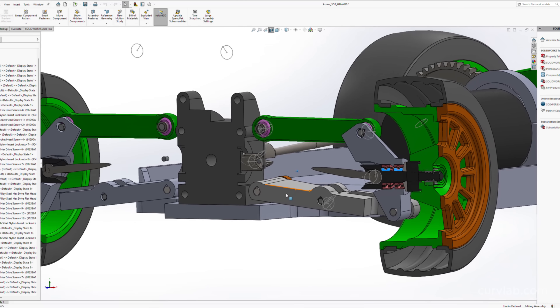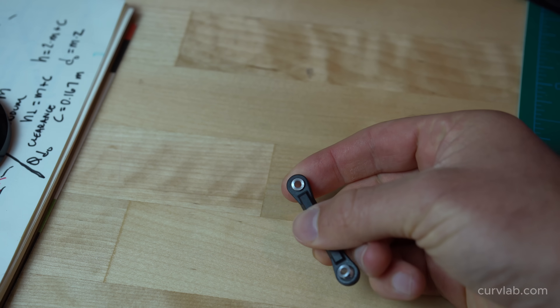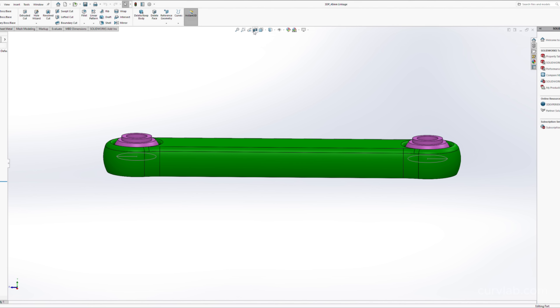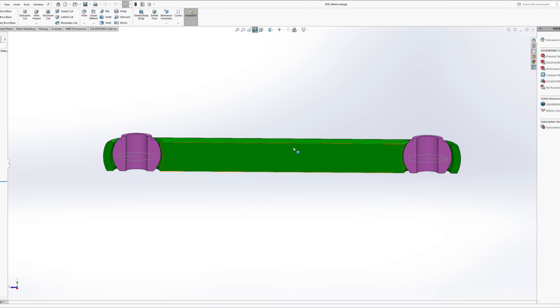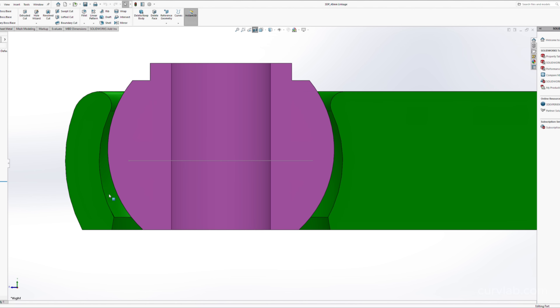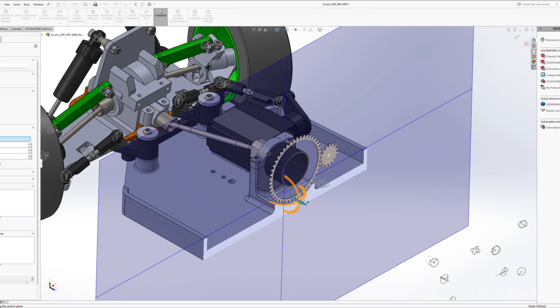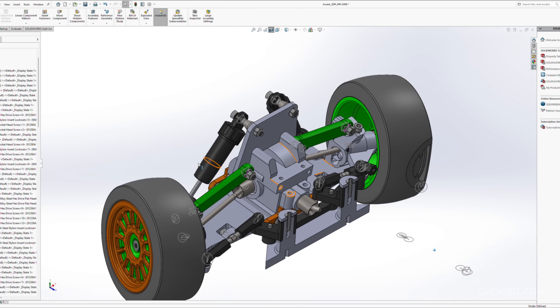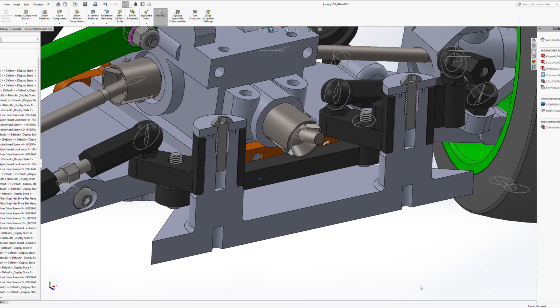One of the most common parts in RC cars are ball-and-cup links, used here as the upper member of a four-bar linkage. Normally you press the ball into the cup using elastic deformation of the plastic to pop it into place. But 3D printing gives us some cool cheat codes — we can just print the ball in place. After a couple of iterations, I got the exact spacing right so that as you pop it off the build plate, the ball remains captured and spins freely within the cup. The steering linkage posts were also substantially thickened and combined into the chassis plate for extra sturdiness.